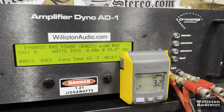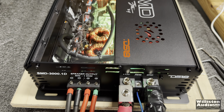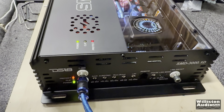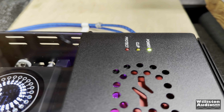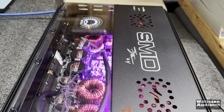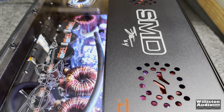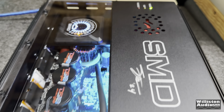Let's try a dynamic burst at 0.8 ohms — 44 watts, and then we immediately go into protect. As with any amp I test, I don't really care if an amp goes into protect, especially lower than the ohm load it's rated for. The only thing I care about is that it actually comes out of protect. In this case, it seems to have been about a 30-second timer and it came out of protect on its own — I thought I was going to have to cycle it, but apparently it just came out on its own. So it doesn't like 0.8 certified or dynamic on the dyno, but with speakers that's wired pretty low when you consider box rise, and the amp dyno doesn't have that. I like the fact that it self-fixes its protect mode and comes out of protect — good job.